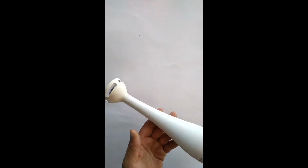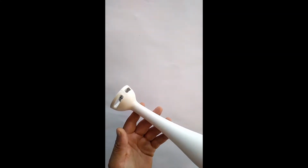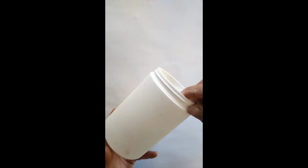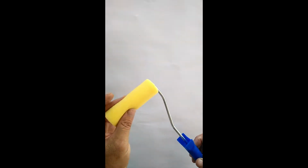The next bottle comes graduated, and we fill it with water, 200 cubic centimeters, which is the same as 200 grams. In our case we will also need the help of a blender. For being small samples we use a kitchen blender. If they were big applications, it would be a cement mixer of the size that is needed. We have also used a scale to control the weights of the materials, in our case to weigh the cement and the foaming liquid. To make the mixture we have used a plastic bottle, to beat well the mixture of cement, water and surfactant or foaming agent.